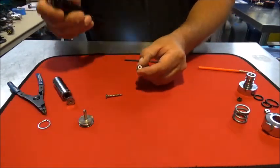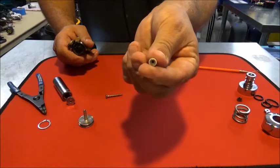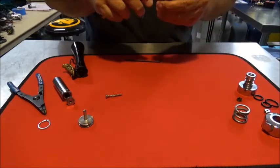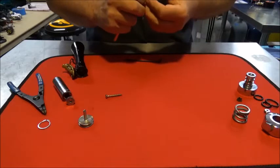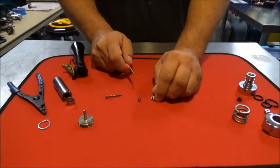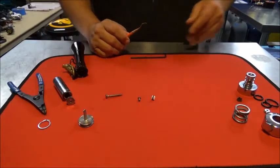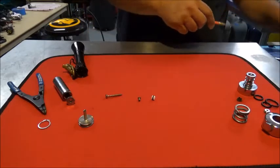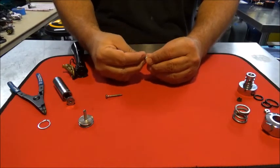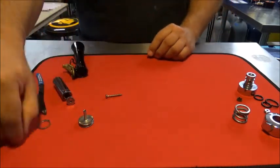Let me set the body aside so you can look at the seat. It's actually three pieces. You can see the O-ring on it and the brass center support. The seat is not reversible because on the back side it's cone-shaped. The O-ring on this seat is an unusual size and I've never been able to find that, so if you haven't seen one that's bad, just leave that one on there - don't take it off. Keep your seat and the seat carrier separated.